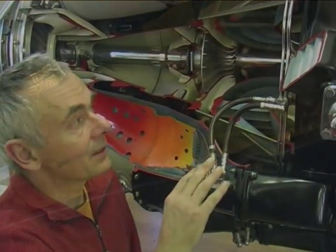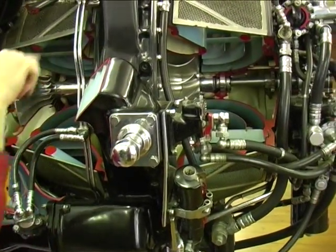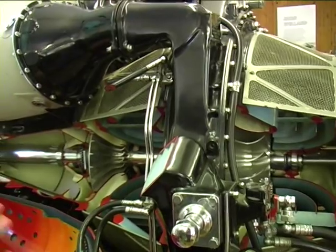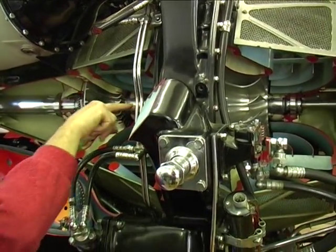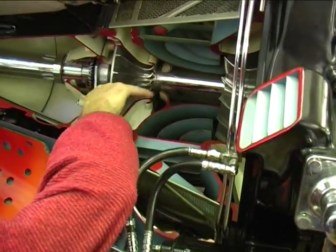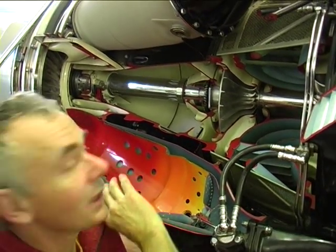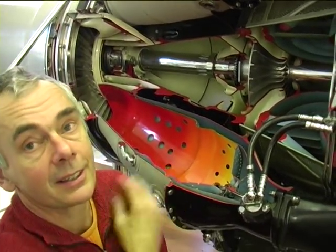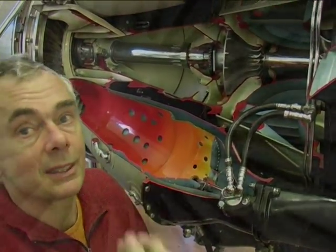Part of the engine that we were looking at previously was the inlet fan. Now on this engine it's a different kind of inlet fan, because it sucks it in sideways rather than straight in at the front. But the actual parts that they refer to normally as turbines in jet engines are the parts in and after the combustion chamber, where the air or the fluid, at which point it'll have the fuel in it as well, is at absolute maximum temperature and pressure.